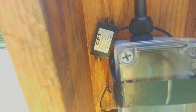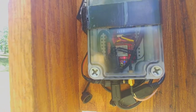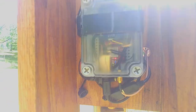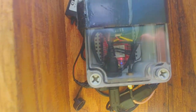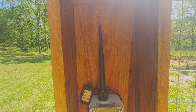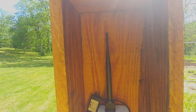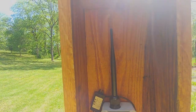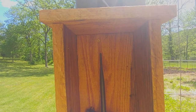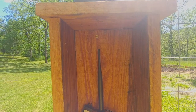And then of course we have our ZF9P module. It's exactly the same setup as we had in our previous video for how to set up the base and rover, so there weren't really many changes there. We still have the 915 MHz SIK radio on here — it's like a 3DR radio — and that is actually transmitting the corrections over to our base laptop inside the building about 100 yards away.